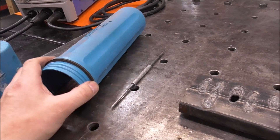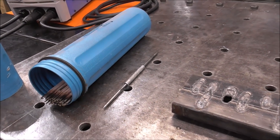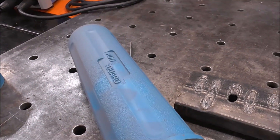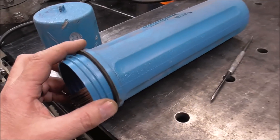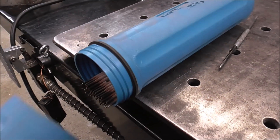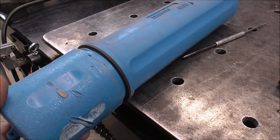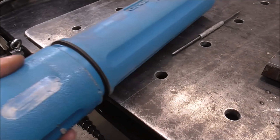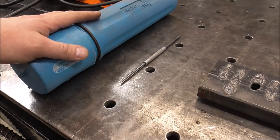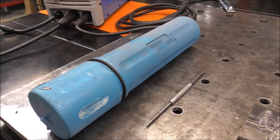Some rods come in cardboard packages that are hard to seal against moisture. You can pick up rod guards cheaply — they have a little o-ring gasket that helps seal out moisture and makes your rods last longer. The 6011 and 6010 are really not that sensitive to moisture, but for rods like 6013 and especially 7018 I try to store them sealed if I'm not going to use them up quickly.